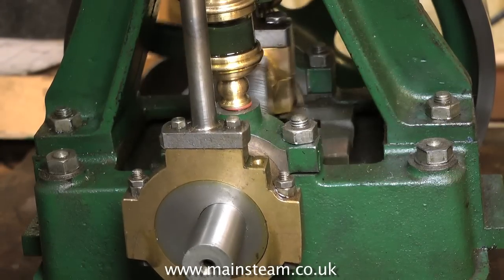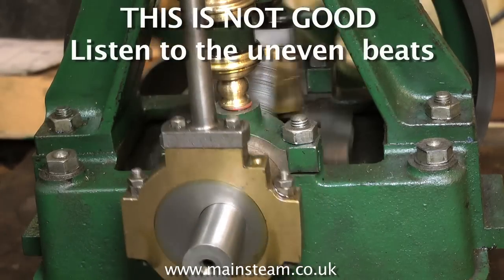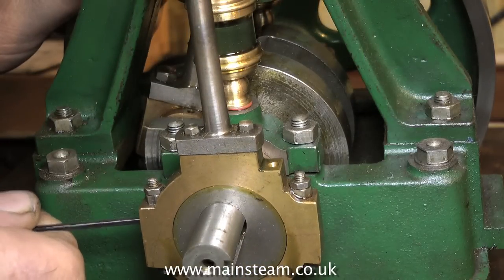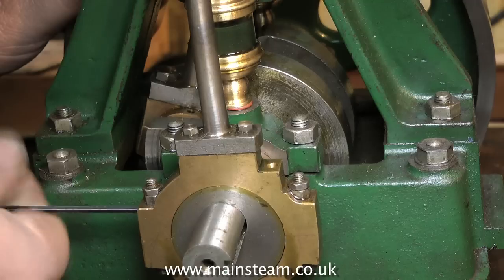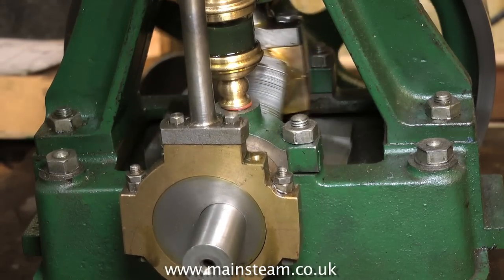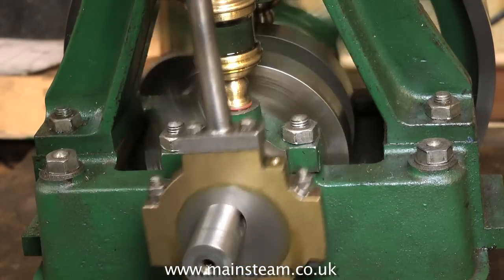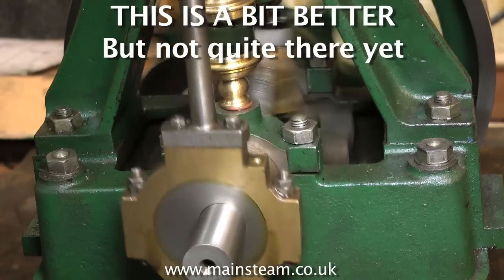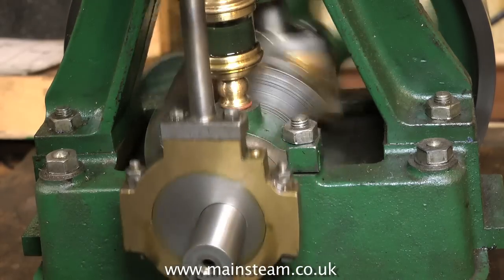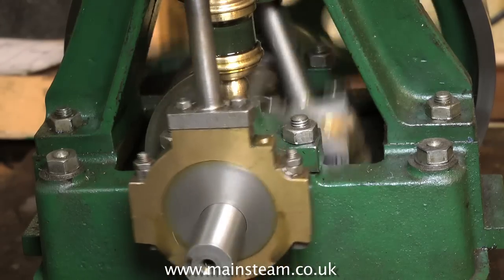You should be able to see what I'm doing here, so I'd like to say one or two things about steam engines and admission. You do not necessarily want the steam to enter the cylinder when the piston is at top or bottom dead centre. What you need is for the steam to enter slightly before, which cushions the piston and pushes it back down the cylinder in the opposite direction. When live steam is admitted to the cylinder it immediately starts to cool, and as it cools it expands — this expansion gives an extra kick to the piston and really bounces it down the cylinder. You don't get this effect with compressed air, which is why steam engines always run much better on live steam, provided they're built and set up right in the first place.